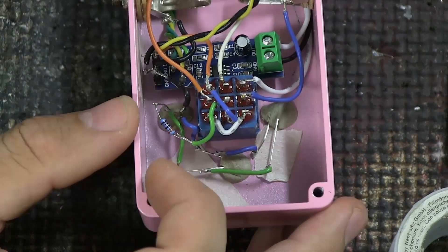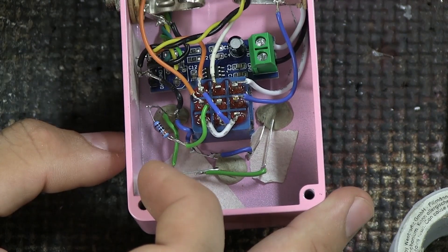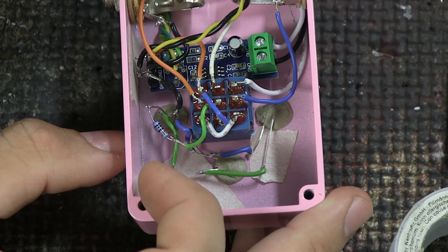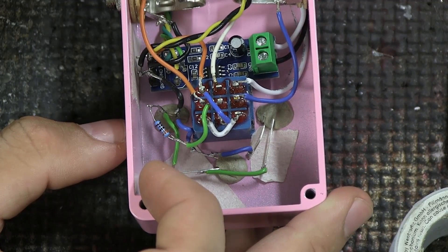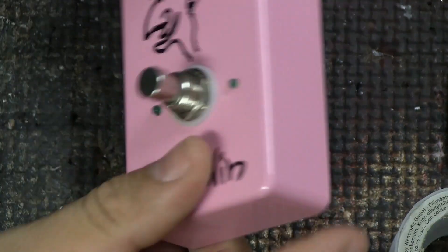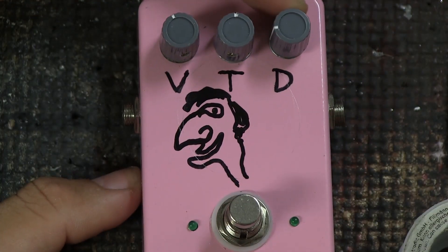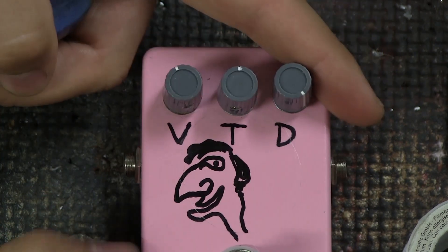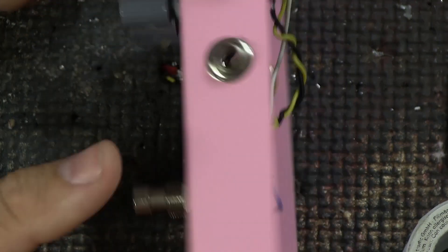This distortion control is just jumper cables to this switch from the connections where the little trim pot was. You basically just cut that trim pot off. I keep the legs that the trim pot has on the circuit instead of desoldering the entire thing — because it's easier to connect new jumper cables to the cut-off legs than to try to desolder those super tiny little holes and put in new fiddly wires. I crisscrossed the two outer legs so that this one goes over to that and that one goes over to this.